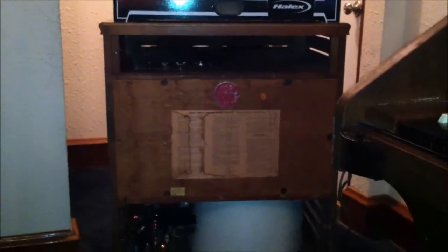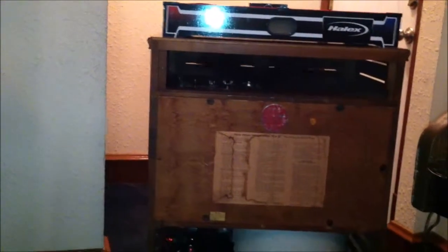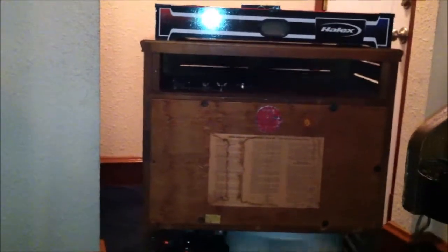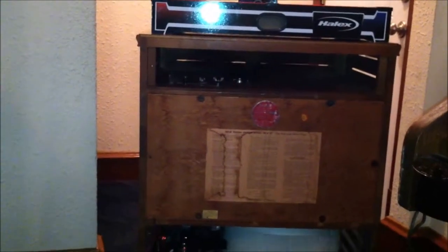And then we're going to go to stop. And this actually takes about 5 seconds or less, depending on how it responds. I've seen it take 5 seconds. I've seen it take 1 second. So it's just all in how it responds. Okay, so we're going to go to the middle and hit off for brake. And what it actually does for the 5 seconds is it coasts the motor so it can get that lower rotor down to enough speed so when it goes to brake, that lower rotor is not just constantly coasting. So we'll go to off.